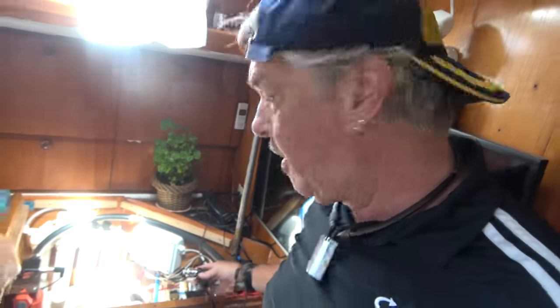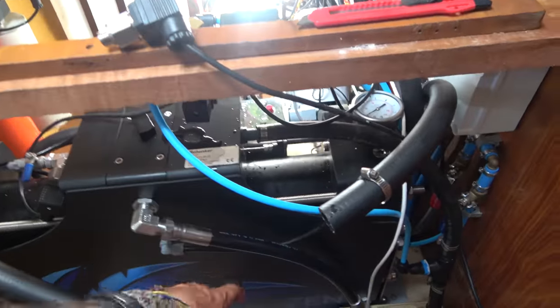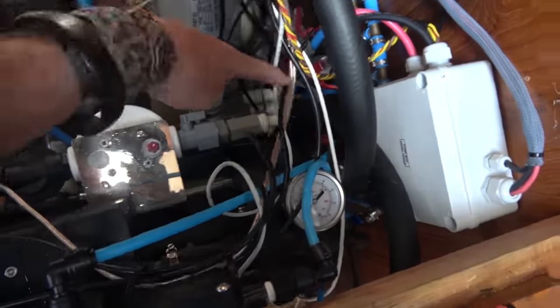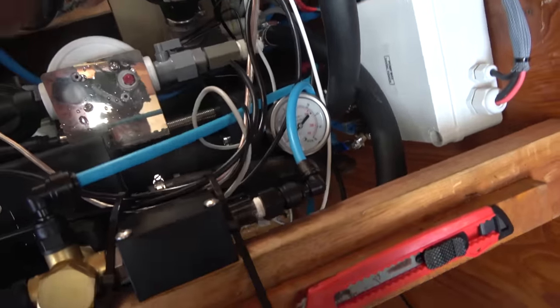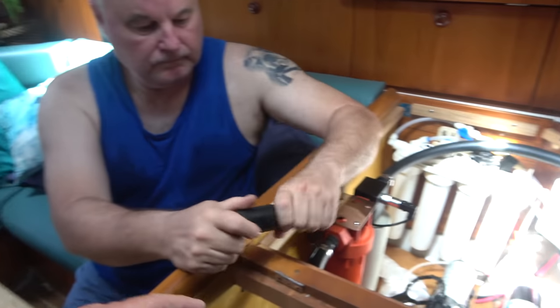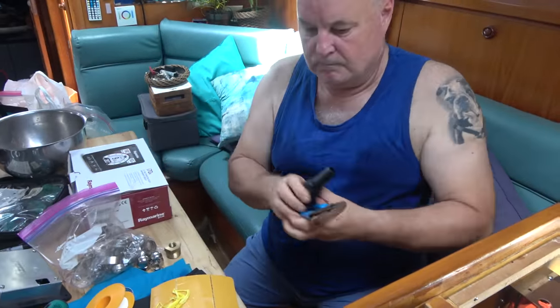The last thing we need to build down here is our pressure switch, which is an emergency pressure override for the water pump. If the hydraulic pressure inside the unit gets too high, it's going to shut the pump off so it doesn't just keep pressurizing until something explodes from water pressure. We're going to put it right in our high pressure line that comes right off the pump. That line comes straight down to the outlet of the pump and into this pressure switch. Steve is just working on the T-valve here — it's high pressure so we need to make sure everything is nicely sealed with Teflon and tight.